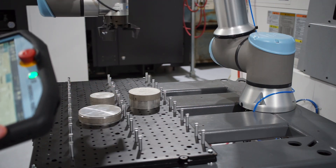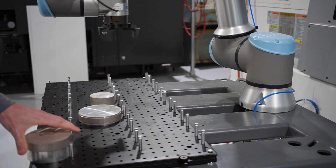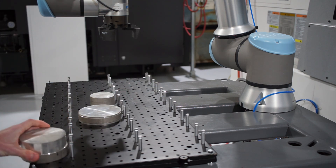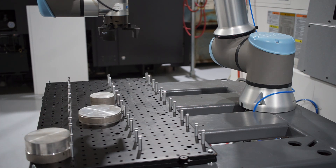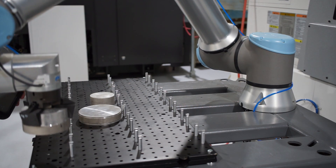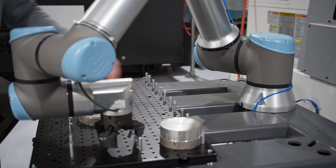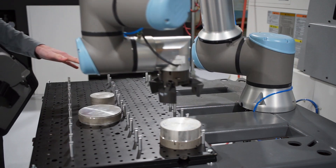Since I have my 4-inch set already, I might as well use this piece here. It's really 3.95, but 4 inches is 50 thousandths different. If you want to get it exact — I'll show you what happens. For this material, I put in 3.95 and then I run it. You may have heard that it kind of scratched against the pegs — it was really tight tolerance.